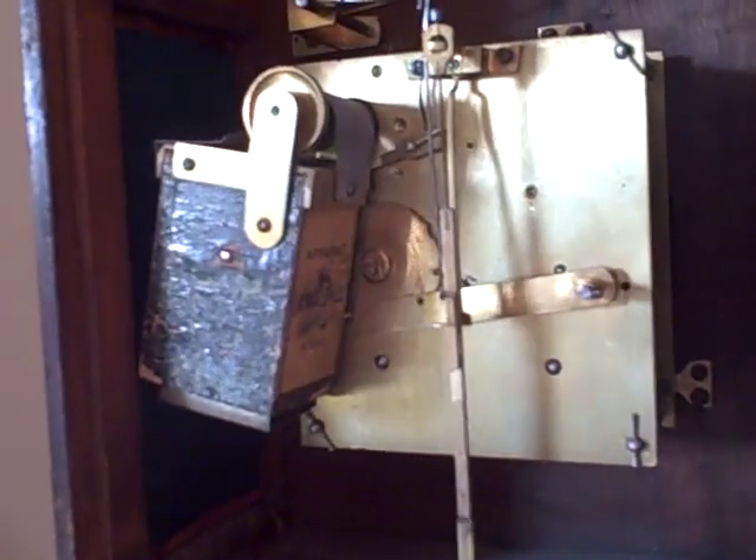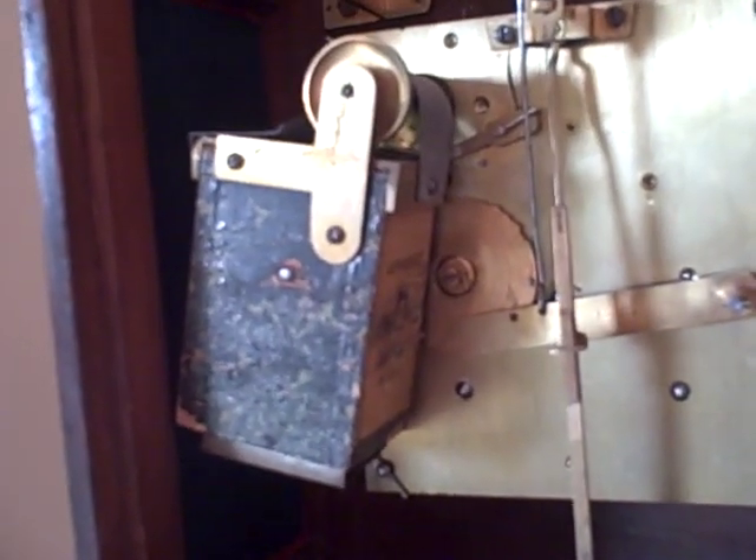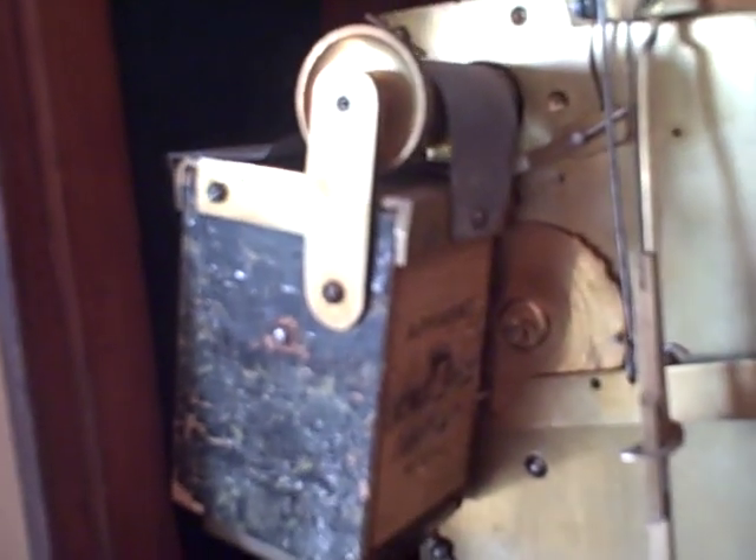There's a wooden squawk box or wooden chest mounted on the back of the movement. It's a hollow wood box, and inside that box there's a metal diaphragm that comes up to the very top into a reed — a thin metal reed — and on top of the reed there's a serrated wheel underneath this tin diaphragm that rides on the top of that reed.